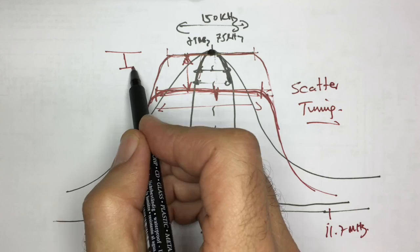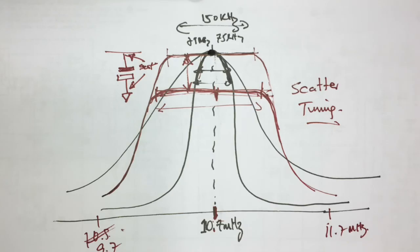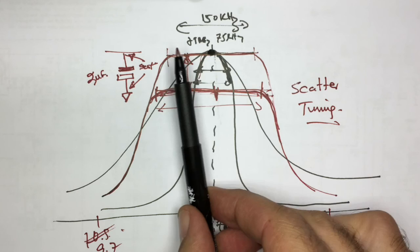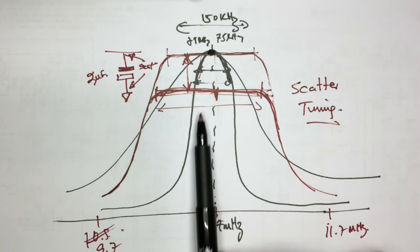You're measuring across there, really. So that's your scope. So you're measuring across an electrolytic capacitor. It's 2 microfarads in this case. So I would imagine that the faster you make the sweep, the slower the response will be, so the more distorted it'll be. So in effect, if you make this very, very fast and you get a perfect slope like that, my guess is if you measure it at different frequencies later on, you'll find that it's not as straight as you might think.